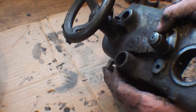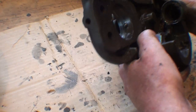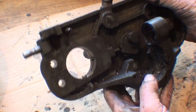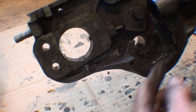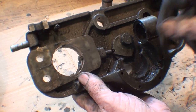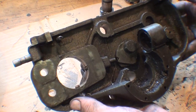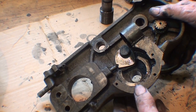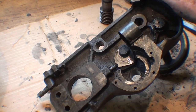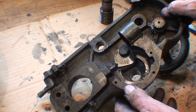Looking now at this oiler here, this gets a right angle oiler that feeds oil by this little hole here - probably into a bit of a reservoir. And apparently then it gets spun by that gear or distributed. Because there's only a few oilers on this whole piece. Now I'm going to put this in the solvent pan here in a second, let it soak, and I'm quitting for the day because I'm running out of steam. Then I'll be able to examine this. But there isn't anything here that is unusable. There are worn parts - the gears themselves, most of them, are pretty good.